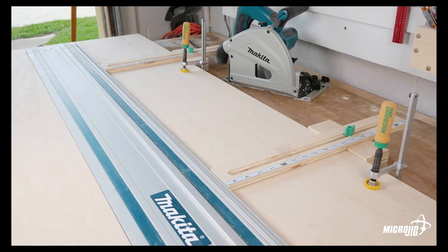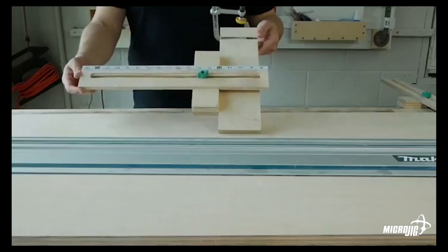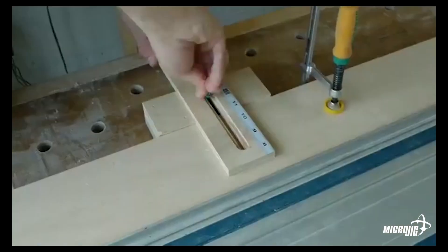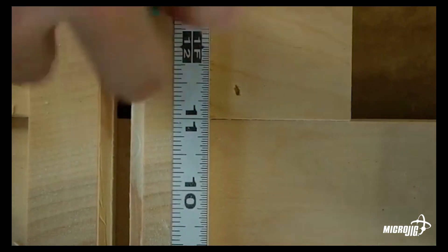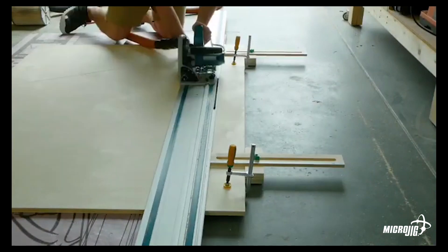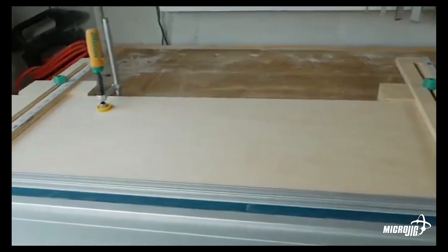This next fella, Past Envy, is actually from my hometown of St. Augustine, Florida — and in a roundabout way, sort of a family friend. I really liked his parallel edge guide for his track saw. Different track manufacturers make their own versions of these, but what his has that they don't is the ability to actually clamp it directly to the sheet quickly and easily — two separate units that are small and easy to carry to the job site. As a cabinet maker doing installs or countertops, a lot of times you need a very slightly angled cut, and these let you measure and do that right off the bat. It's a very elegant, minimal design making the most of two clamps and two pieces of hardware.